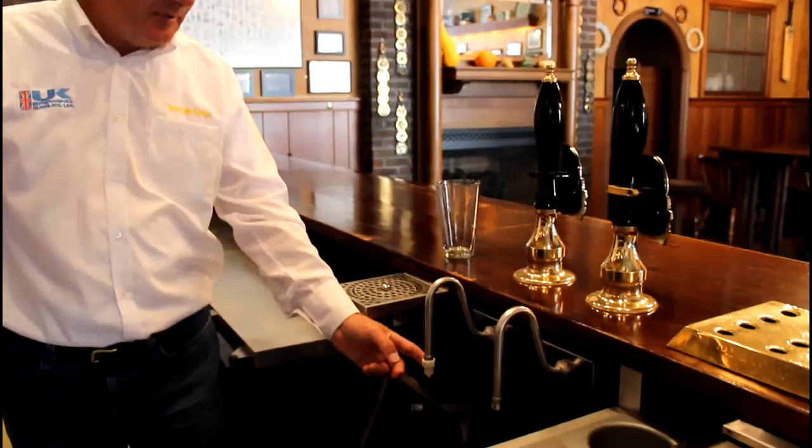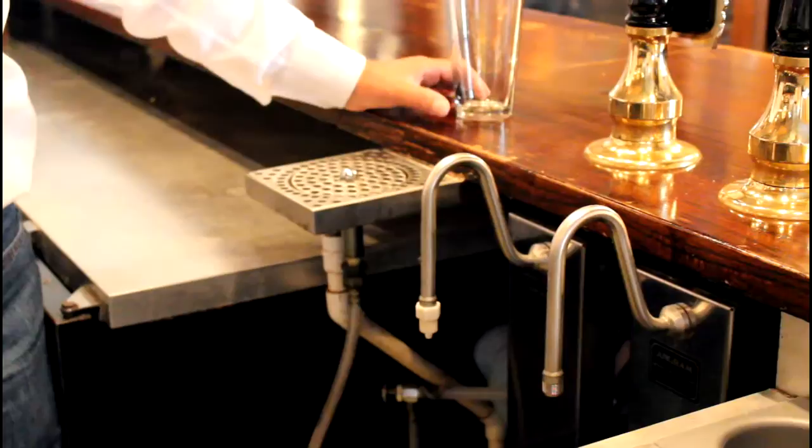The sparkler is the plastic tip that is at the bottom of the gooseneck. The holes in the sparkler are 0.6 mm, and that's the standard that comes with all beer engines. We do offer it with 1 mm holes. Obviously the smaller hole will form a tighter head.